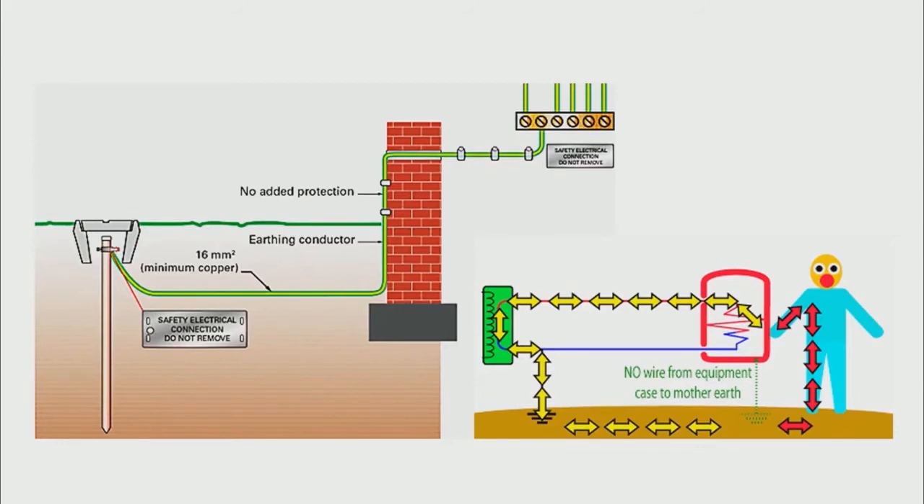Like we already know, the transformer has the power line connected to it, such as the phase and neutral lines. For that it is necessary for grounding to happen to pass these lines to the transformer. Similarly, in a building grounding or earthing needs to take place. If there is any problem in the earthing in the house and if you touch equipment such as a motor or computer that is metallic, you will experience a current. If the equipment is non-metallic you won't experience any current.